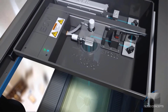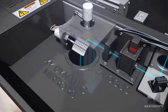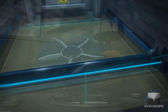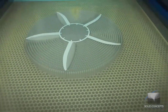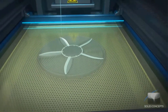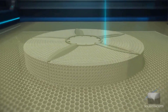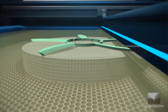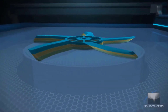It's worth mentioning that most desktop SLA printers work upside down — that is, the laser is pointed up to the build platform, which starts low and is incrementally raised. After finishing the material polymerization, the platform rises out of the tank and the excess resin is drained. At the end of the process, the model is removed from the platform, washed off excess resin, and then placed in a UV oven for final curing.